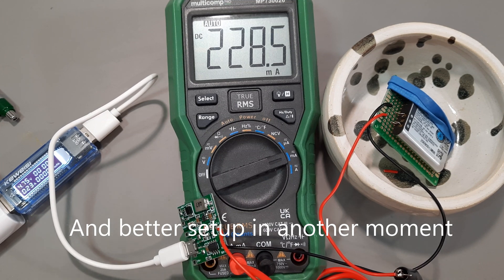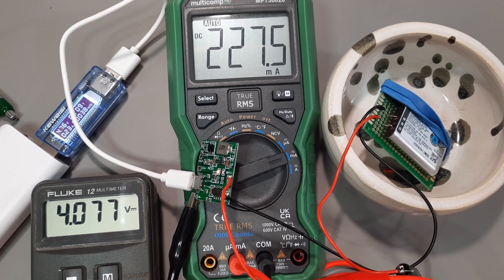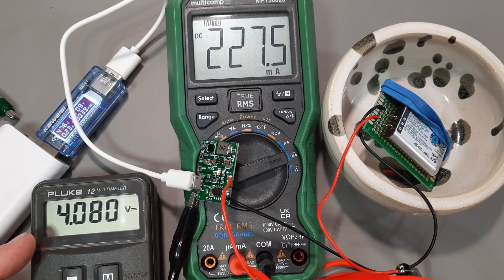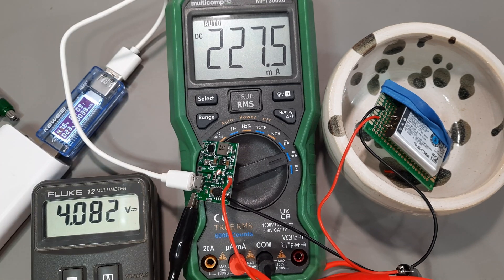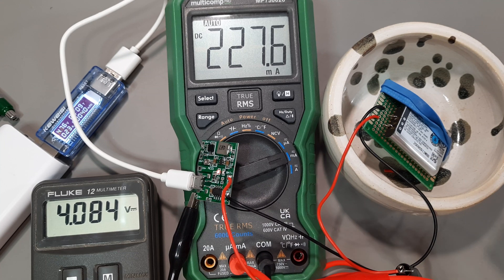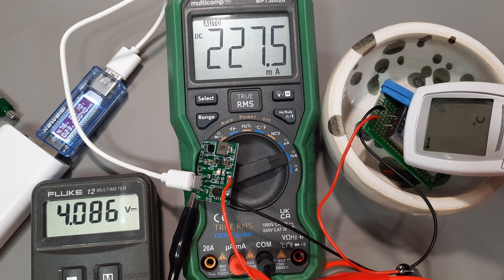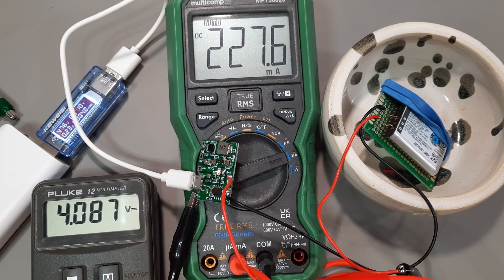It's all set up — 228 milliamps. This has been going for a few minutes. The battery voltage has climbed slowly and is still climbing; the current is still about the same. I've periodically checked the battery temperature — and instead of using my skin I'm using a temperature probe — and it doesn't indicate that it's heating up at all. It'll be interesting to see if it actually took a usable charge, or if it's one of those where it claims to be full but you get nothing under load.